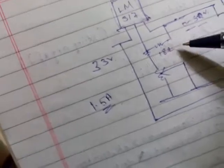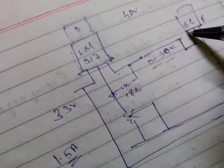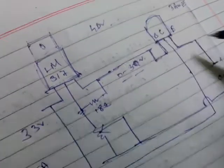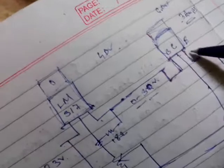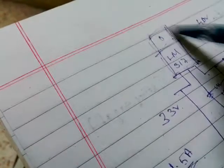By regulating the base current of this transistor, we are actually regulating the main current that is coming through the collector and going out to the emitter. This power transistor can handle a maximum current of up to 6 amps, so it can easily handle our circuit current of 3 amps. If you are considering a low-power circuit within a range of 1 amp maximum, you can use only the LM317. But for higher current circuits, we use the TIP41C power transistor.